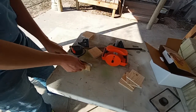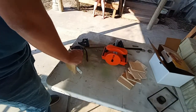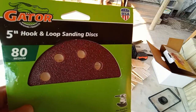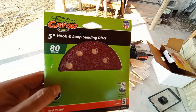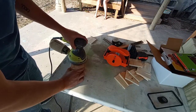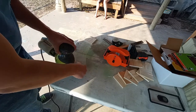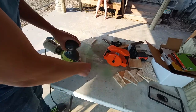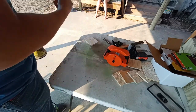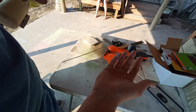All you have to do is take your flush cut saw and cut those right down the middle — now you have two coasters. After this, get your sander. I use 80 grit sandpaper for the first pass, just because there was a little leftover material in the middle from the flush cut saw. That 80 grit takes it down quickly and then we move on to 220 for a final finish.